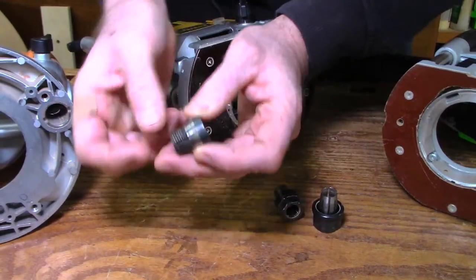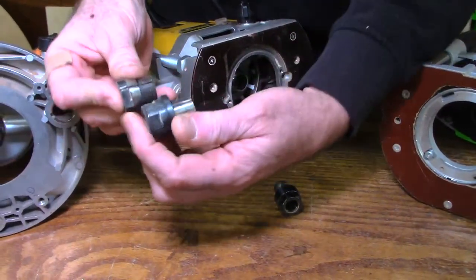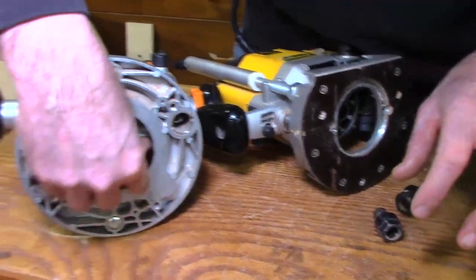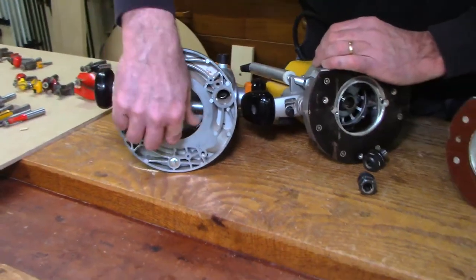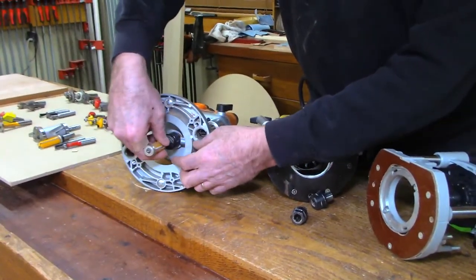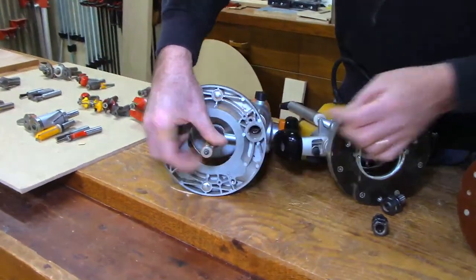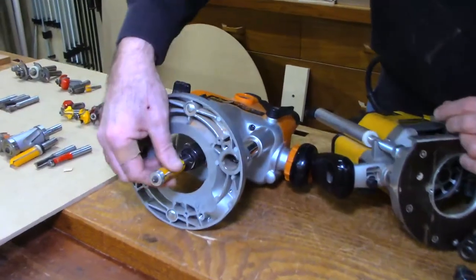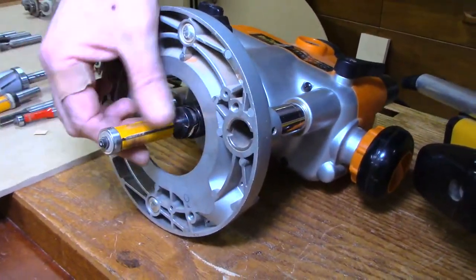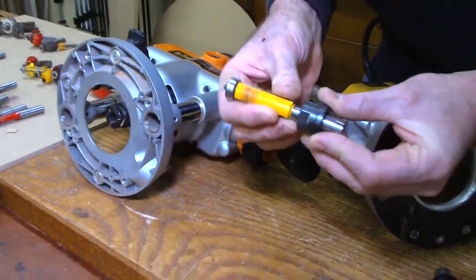So you don't have that added length or that second interior sleeve that really gives you a longer, deeper grab on that piece. So this is fine, but I would get nervous sometimes when I have a longer bit in that. If I was on the table, say a bit like this, you're only working with a certain amount of that shank in there. It makes you a little nervous. See, that only goes in that far. I still got half an inch of that shank there. I would be nervous to run this bit on this router. Maybe they've changed that since, if you guys know.